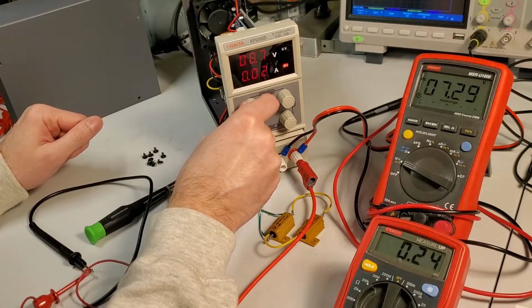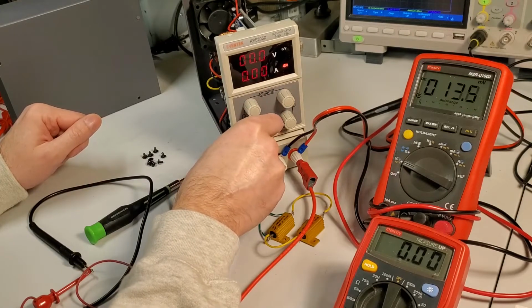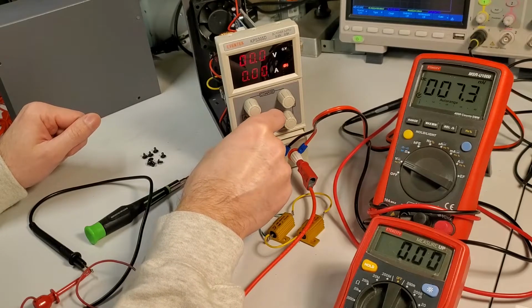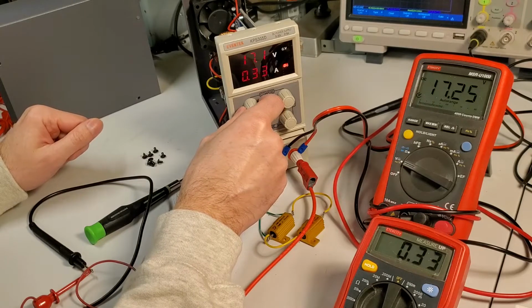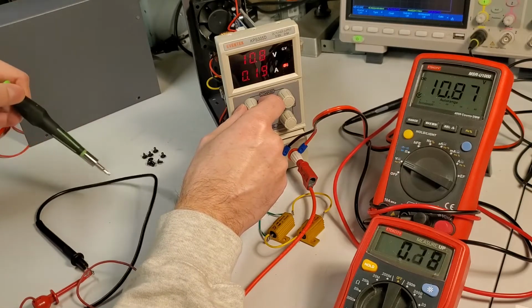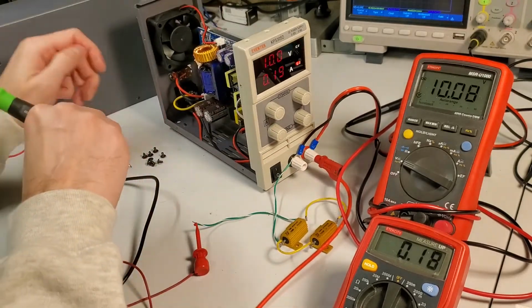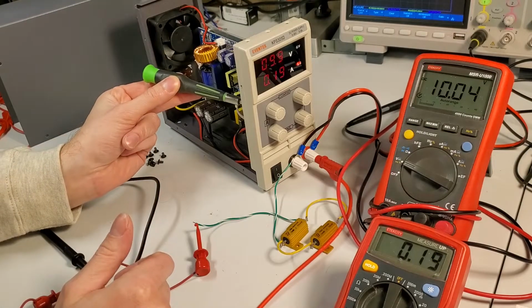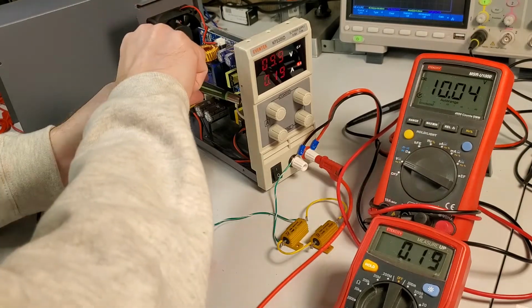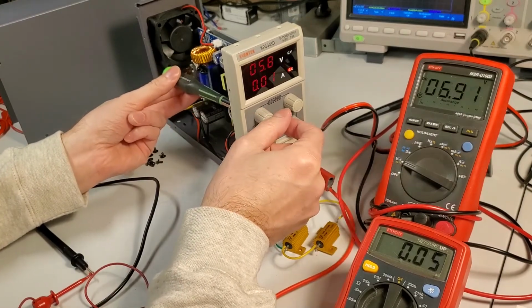Current limit kicks it out pretty fast. Now this is something that always has bothered me, is the current limit goes way below 0. Way below 0. You have to turn this up quite a bit, probably about 20-30 degrees before you start getting current limiting. So this is a case where I would question, is that adjustable with this screw? Because that would be nice to have a little bit more dynamic range here.